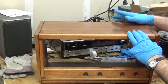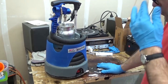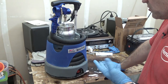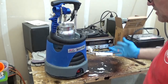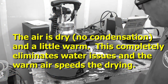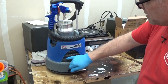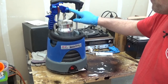I shot the lacquer with my HVLP gun, which I'll show you in a minute — you've got to get one of those if you haven't got one. I bought this thing about three years ago at Woodcraft. I think I paid $300 for it. It is a self-contained HVLP. HVLP stands for high volume, low pressure. That means you're putting low pressure, so you don't get nearly as much blowback, nearly as much mist in the air, and overspray. It comes out much gentler and you put a lot of volume out. It's using a motor like a vacuum cleaner motor but in reverse, down here in the base of it, and it comes through this tube and into the spray gun right up here at the spray head.